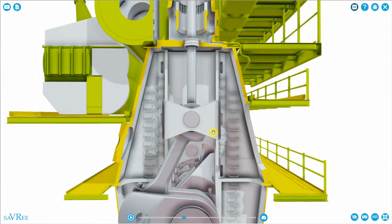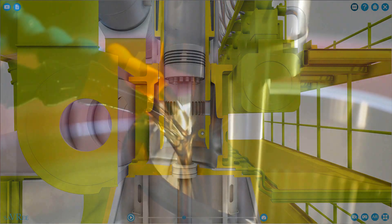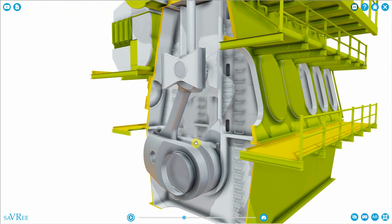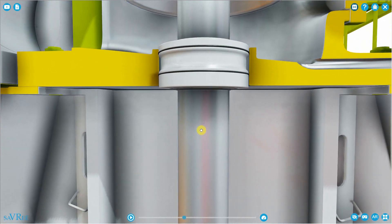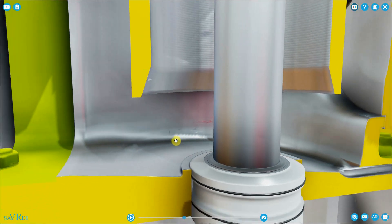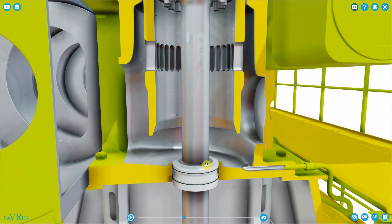On the opposite side, looking at what could travel up from the crankcase into the scavenge space, our focus is lubricating oil. There's a lot of it splashing around, coming out of the crosshead and all the bearings. Some of it ends up on the lower side of the piston rod. We don't want to carry that oil into the scavenge space because it could introduce potentially flammable material there. If there's a crankcase explosion, we don't want to feed it with scavenge air, and the stuffing box prevents that.